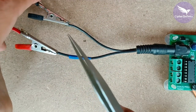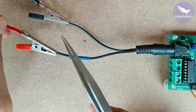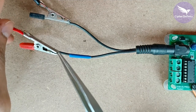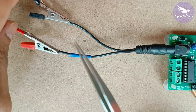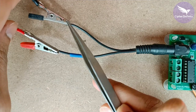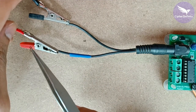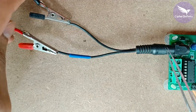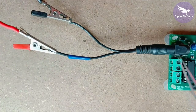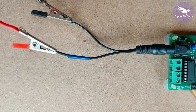These are basically the two wires through which we are powering our system, and these two wires are actually coming from an external power supply. I have set the voltage of the external power supply to 12V. This is the negative terminal — you can see the black color — and this is the positive terminal represented by the red color. We are getting 12V on the input side of the 7805 IC through this DC male jack, and this is how we are powering our hardware.